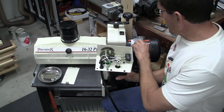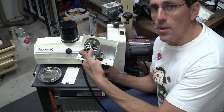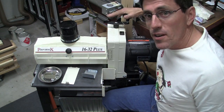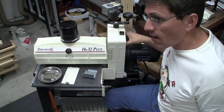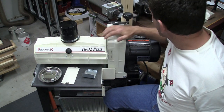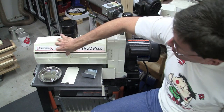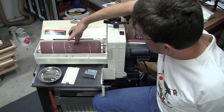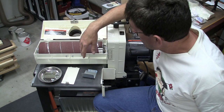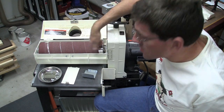On the inside they installed a little plate to keep the motor from rubbing against the wires — a smart move. For a fast tour of the drum sander: this portion here simply raises and lowers the carriage, which is very stout — a large plate of metal riding on two large ribs on the inside of the stand, the same on the older Performax. This lid has a four-inch dust port, though it does have a tendency to catch. The drum itself is just a very large drum — you pop a sheet of sandpaper all the way across and there are little clips on the end. They claim you can do it with your fingers, but there's a little tool you use to reach in and set the clip.